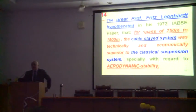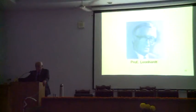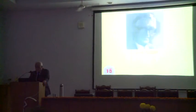The great Professor Leonhardt hypothesized way back, he is no more, he's dead, in his 1972 IABSE paper that for spans of 750 meters to 1500 meters, the cable stayed system was technically and economically superior to the classical suspension system. And if Fritz Leonhardt makes that statement, you just don't question. Especially with regard to aerodynamic stability, but not for railway bridges because of the impact, because of the vibration. This is that Professor Leonhardt.